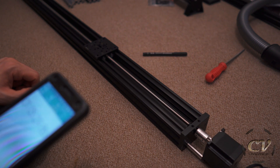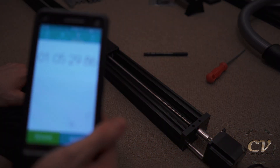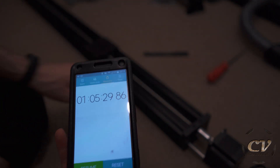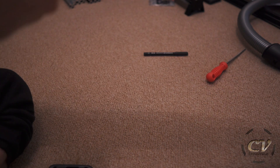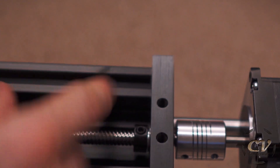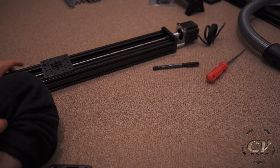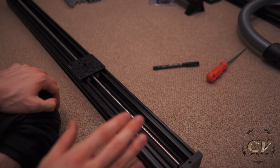I'm done with the build, but I messed up the recording — I tried to film a timelapse but actually filmed 120fps slow-motion video. It took me one hour and five minutes. I think this build could be done in half the time if you don't go for this fancy screw-flush approach. Other than that, I did not treat the C-Beam, and it's super apparent that this is not a 90-degree angle — the light actually shines through. But I think this is not a massive problem for this actuator, since the idea is that it will be the base for a camera slider.